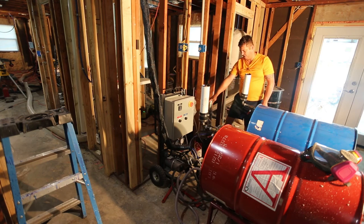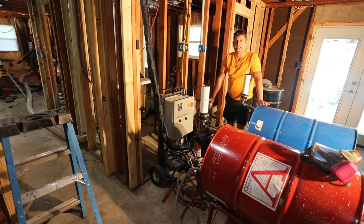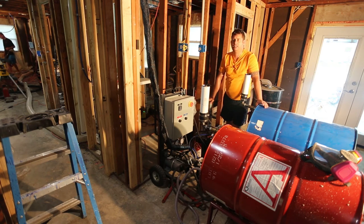There's also a pump that you may or may not be able to see here. I've got an acetone pump, and that's just part of the purge system on this gun. This is really a simple way to deal with it. Graco has SureShot, I think they call them SureShot cartridges. They're a little bit on the pricey side, and it's just a solvent dispensing system to clear out the foam. So if they had a fourth line on their gun that handled a solvent like acetone, you could do the same thing on that type of gun.